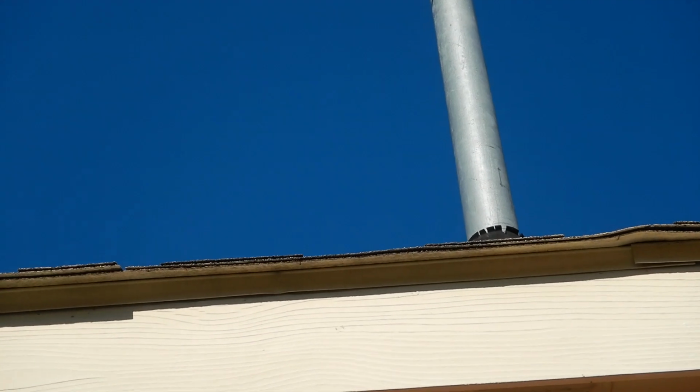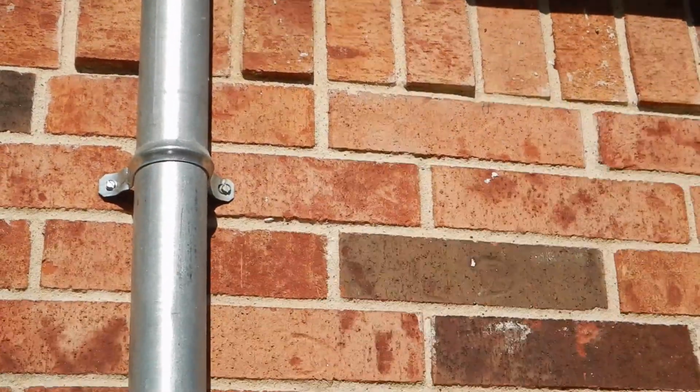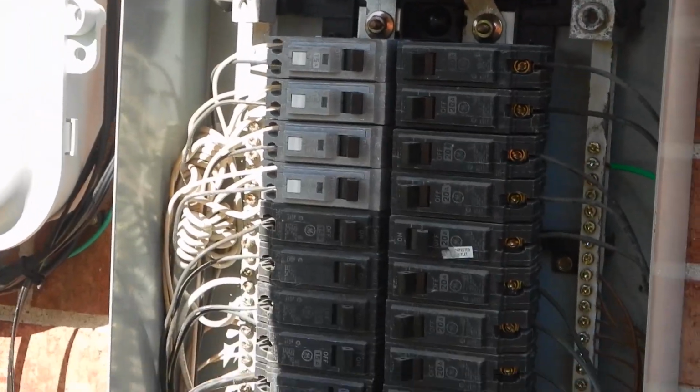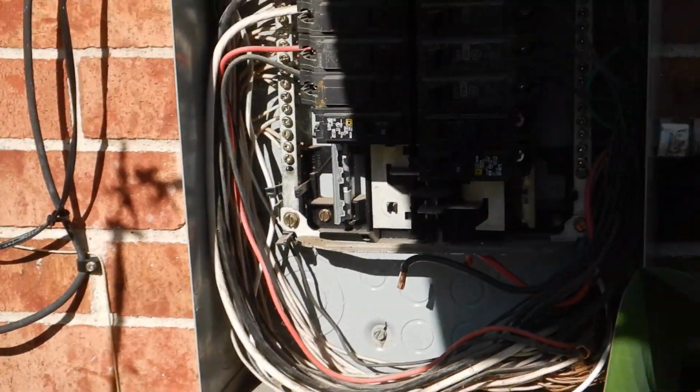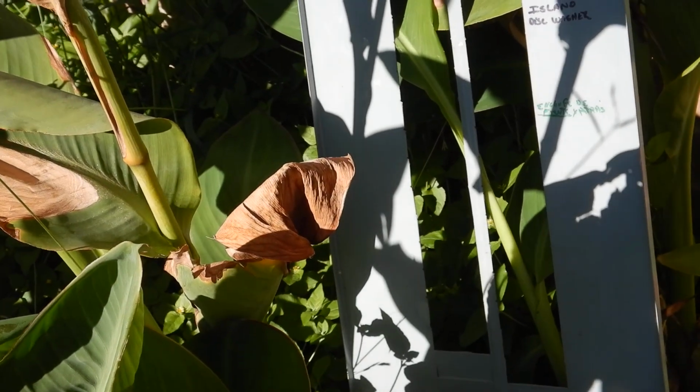And that's it. So what did we learn? We learned that we got a little bit of broken insulation on the cables coming into the weather mast. We learned that the weather mast gasket is split and torn. We learned that the meter and the disconnect box, the main load center box, should be sealed on 3 sides. We learned that the load center dead front cover plate was not properly labeled. We learned that our bonding location was not labeled.